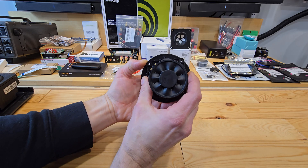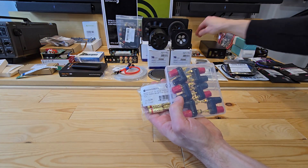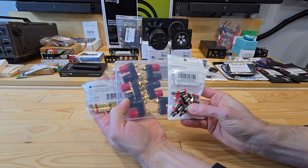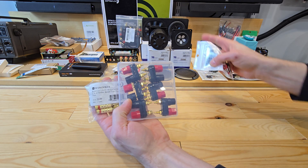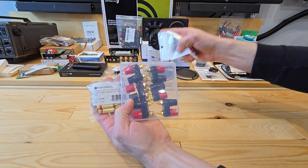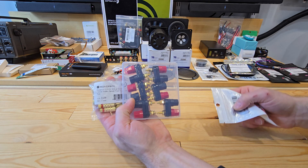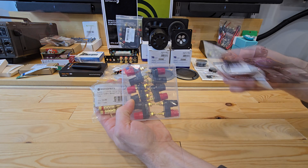You can find all the parts in the description of this video. Last up on the audio front, I plan to extend the amplifier's output to the rear with banana jacks. From left to right are plugs for my office speakers, binding banana posts, and smaller banana jacks. To switch off the internals, I will have a push-button switch for each the subwoofer and two mid-ranges. This will not only allow me to disable internals for external speaker use, but also perform troubleshooting as needed.